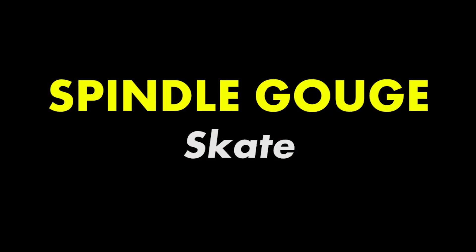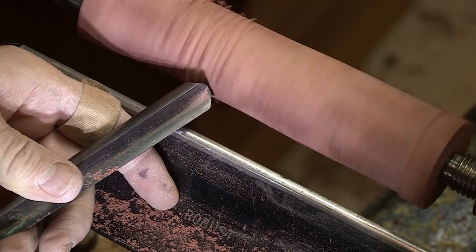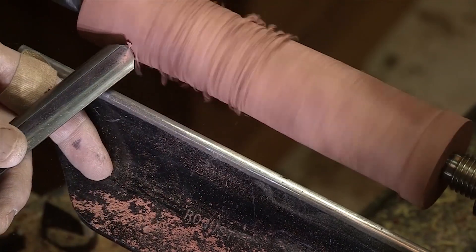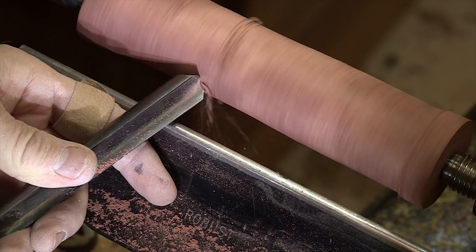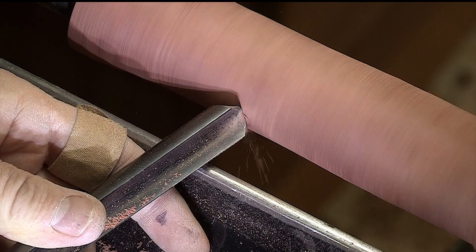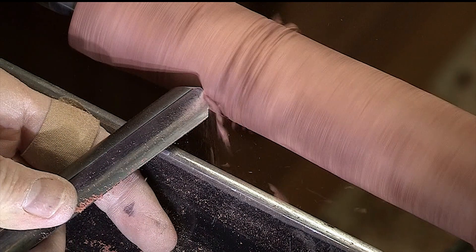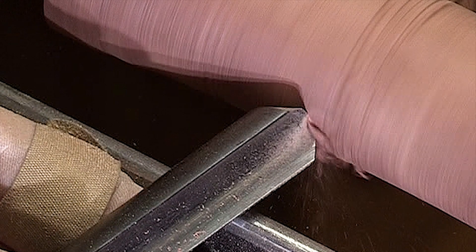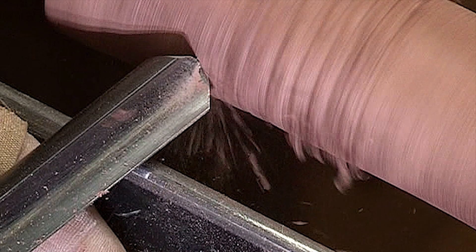Now, the skate. The skate is the most frustrating thing of all because you think you're going along fine and then all of a sudden, whoop, your tool goes running to the back — and look at that major design modification. It takes a couple of things to do it properly, but let's show how it goes wrong first. You can see I'm not using my thumb as a backstop very effectively — I'm not putting a lot of pressure on the tool. You can also see I'm making contact with the center of the point of the tool. The bevel's not rubbing. So all of a sudden the wood starts pushing down on that edge and it literally shoves everything back. With no bevel touching and your thumb not holding against it, it wants to skate.